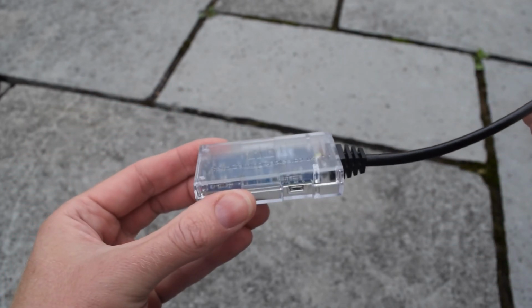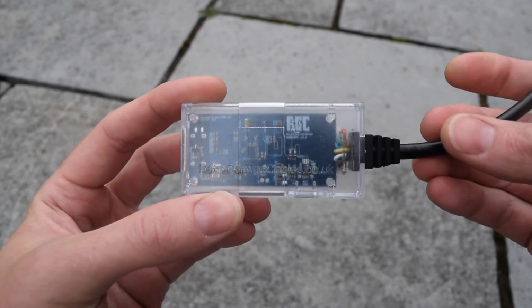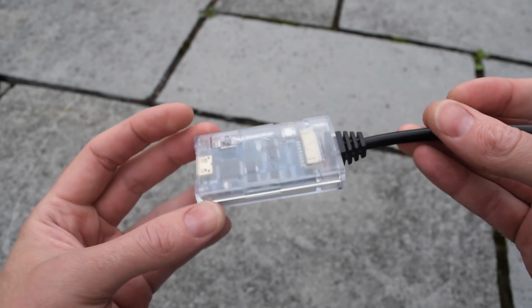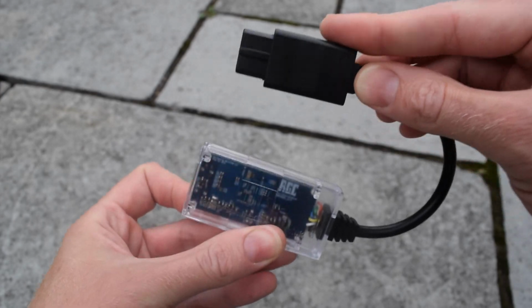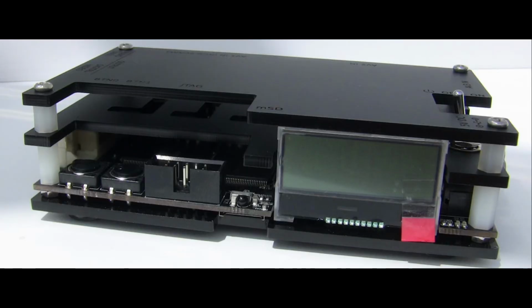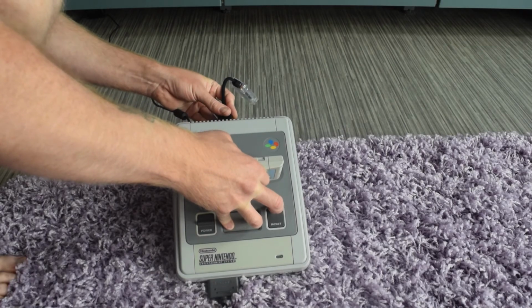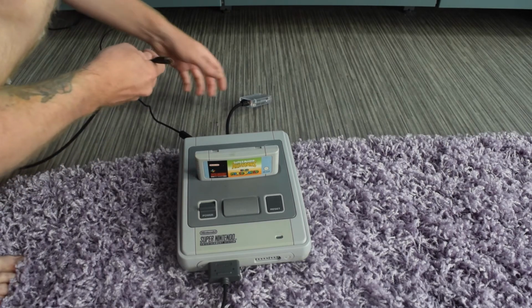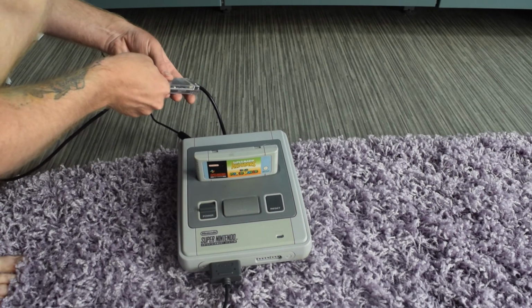The TV then handles the upscaling after that to fill the screen. 240p is a weird format which your TV might not understand, while 480p it should be able to deal with. There are other more expensive and complex upscalers like OSSC, FrameMeister, and RetroTink 5X, which will increase the signal up to 1080p or even 4K and give even better results.